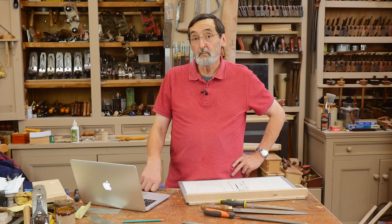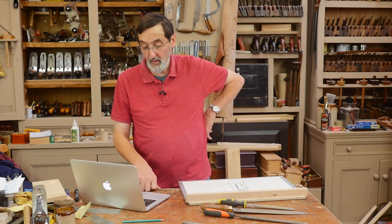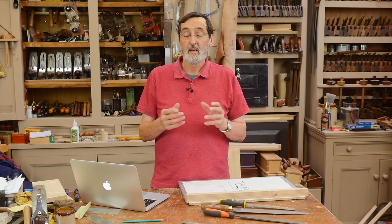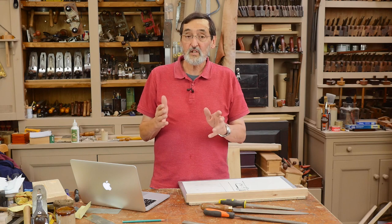Well, that was a bit of a broad sweep that I made with that one, and I'm sorry I said it that way. I was simply reflecting on pieces that I have made outdoors where I've made, say, a garden bench or something like that, and I've laminated 2 sections to make a leg. Within 5 or 6 years, usually those laminations, the sections have expanded, contracted, a little bit of moisture in the joint, and eventually, no matter what anybody tells you about waterproof glue, they do ultimately yield to this expanding and contraction motion that takes place in the wood.